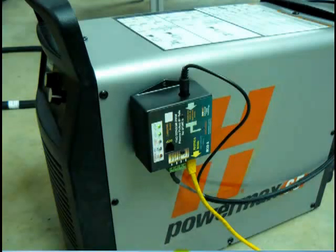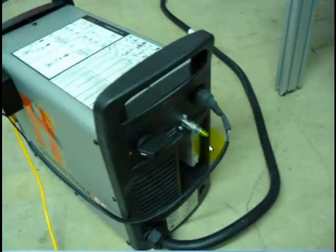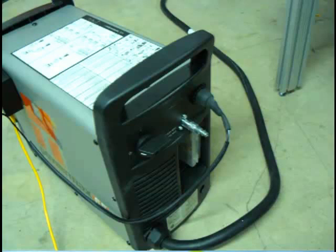You're also going to need to hook up your air supply to your plasma cutter. You definitely want nice clean dry air — it's very important. If you run with wet air or air that has oil in it, you will ruin your tips very quickly and your cut quality will not be as good. I recommend getting a very good desiccant drying system, or even better, a refrigerated air drying system. You will definitely get higher quality cuts with proper air drying.